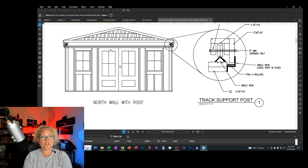I did not leave room across the top of my door for a header board. This is a standard side board that goes all the way up to the top and I've just got a couple of 2x4s up there. I should have had a 2x6 go across the top. In hindsight, I should have made a shorter door — I completely could have done that at really not much extra cost. If you're going to go with 7-foot walls like I did, a standard door at 83 inches is just really too tall, and that caused me to do some finagling to get things to work out.